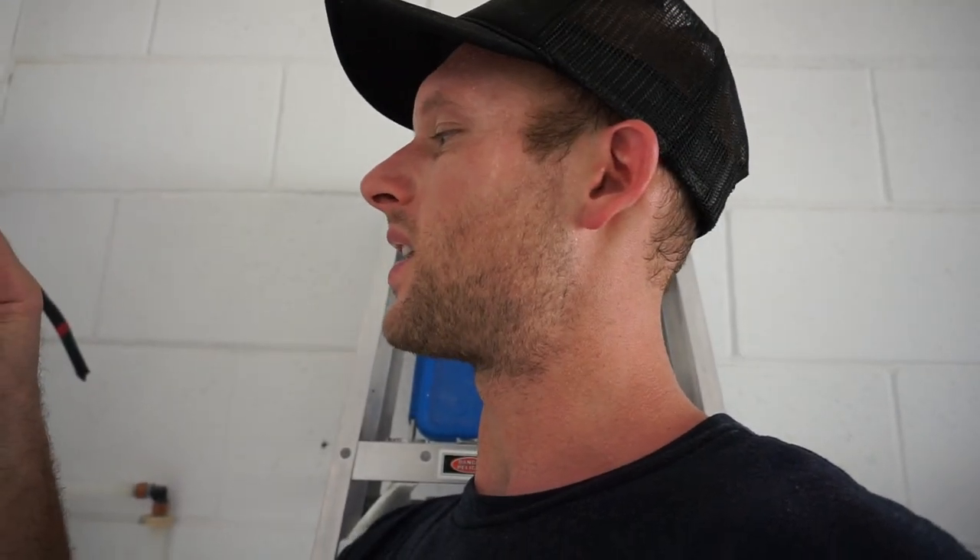I just got off the phone with my electrician — he's kind of walking me through this process. I kind of made a mistake. I got 8-3 Romex and I'm supposed to have the regular flexible wire. The problem started when I found out I couldn't fit all three wires through the wire holder on the water heater, so I gave him a call and he helped me out. I have the wrong wire. But I'm gonna just finish putting this together so we have hot water, and then I'm going to come back later and put the right wire in so it's up to code.